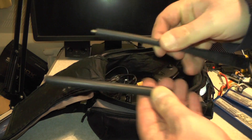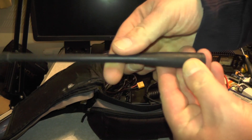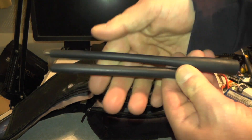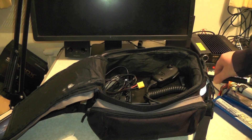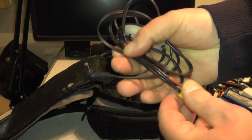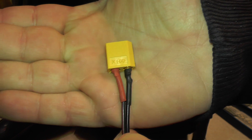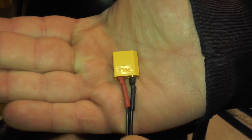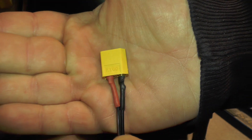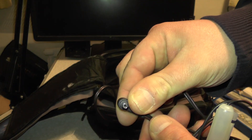I've got this antenna here which screws in at the top there, and that gives us a 6, 2 and 70. So I can do some QRP on 2, 70 and 6 metres. With my 817 I've got a power lead. Now it did have just two bare wires, but I have soldered — not the best in the world because I'm not good at soldering — an XT60 on there. Just makes it a lot easier rather than using Blu-Tac or putting wires in and trying to make a contact with the wire falling out. So plug your battery into there, the other end goes into the radio.